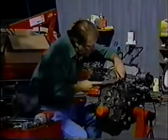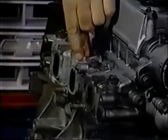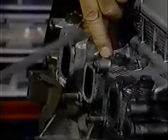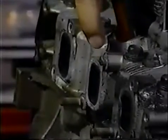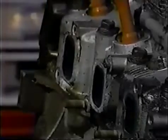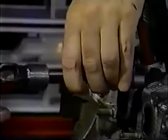What we're faced with here, folks, is an age-old problem — a broken stud or a broken bolt. In this case, the stud broke off outside the casting. A lot of times they'll break off on the inside, but either way, if it's out like this, it makes it a little easier to get it out. I've tapped it a little bit to flatten it and filed it down. Now I'm going to get a center punch and center punch a spot right here in the middle — make sure you get it exactly in the center.